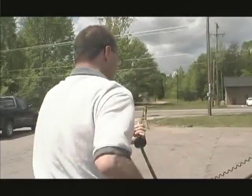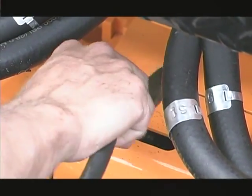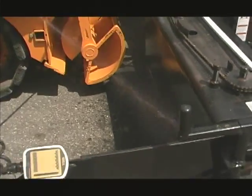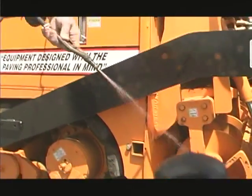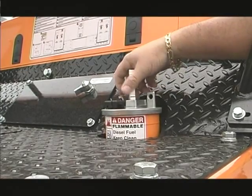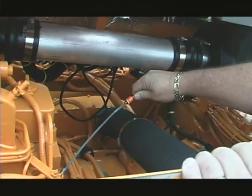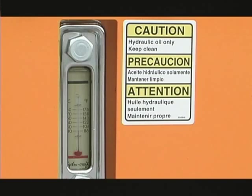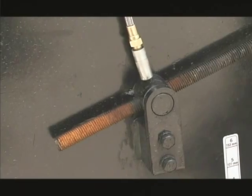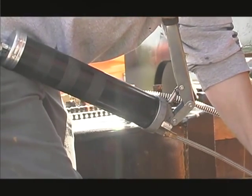Pull out the spray down hose and spray the auger chains through the slots provided. Spray down the augers while they are turning and spray the sides for raising and lowering the augers. The fuel tank should be refilled at the end of the day to keep condensation from forming in the tank. Also check the engine and hydraulic oils and replenish them if needed. Lubricate the thickness control screws and the extension slides with grease to keep all the parts working smoothly.